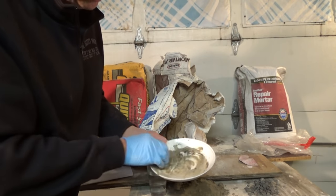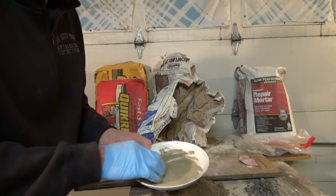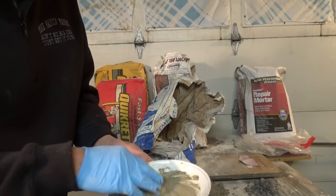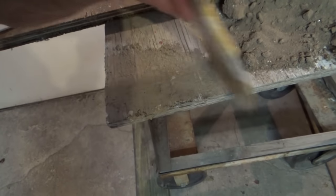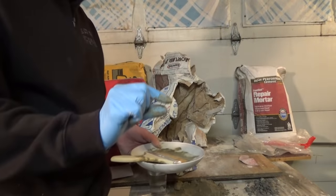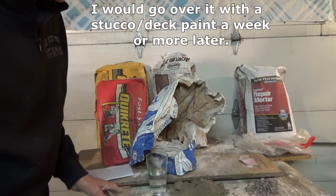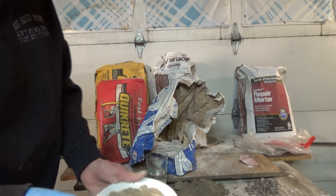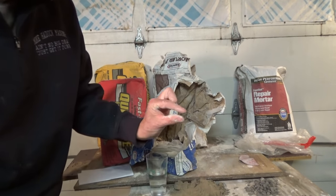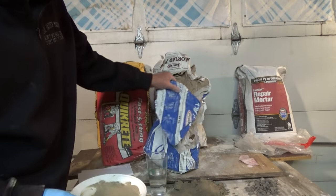Three thousand PSI is pretty strong — that'll be a footer kind of concrete. After six days it goes up to 7,000 PSI, so that's really strong. But it's gooey and you'd have to form it, and it was kind of going all over the place. Another thing you shouldn't do is make a paint out of it and paint a driveway or anything, because you have to have more than a quarter inch to make it really stick. You'd use this for going over steps where you have to go real thin, smooth it off really good, then paint over it.